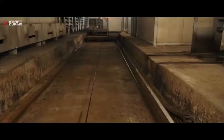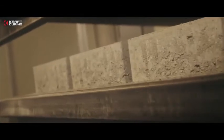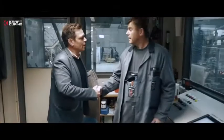It's a very, very gentle, barely noticeable airflow. The racks, the boards — everything is dry. Everything is dry except for the concrete. Quadrix is truly exceptional: the racks, production pallets, floor, and ceiling are all dry. Dennis wonders what the humidity in the curing chamber is. He finds the answer by speaking with the production manager, who can monitor and control Quadrix from the control room.